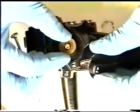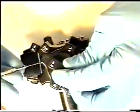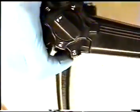Once you have achieved the proper locking feel for the left-right knob, then you can reseal the knob assembly. Again, be sure that both free knobs match in diagonal position. It may take several times in order to match these. Be sure to tighten down the 3 set screws properly in order to seal the left-right cap to the body section.